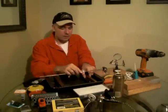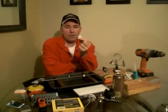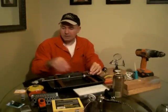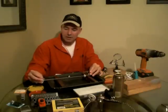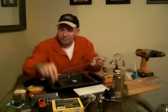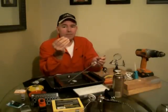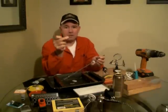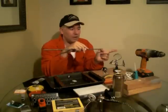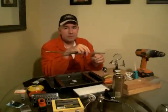Test these with the rod coming through the roller blade bearings. I'm using two 1/16 inch thick nylon washers — they've got a quarter inch hole in the middle and are about 7/8 to an inch in complete diameter. Those get sandwiched on the outside of the rod, and just past that I drill a hole all the way through using my smallest drill bit — 3/32 inch — just enough to get cotter pins through. The cotter pin is about an inch to an inch and a quarter, looks like a little hairpin, and goes through that small hole. Drilling these holes is difficult with a cordless drill, so a small drill press is best.